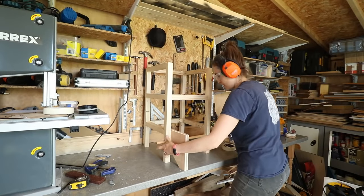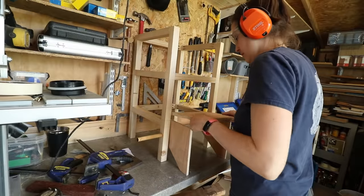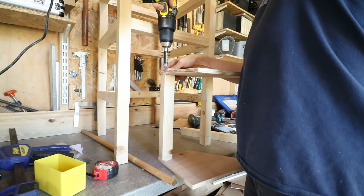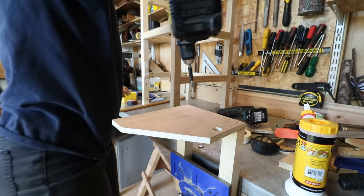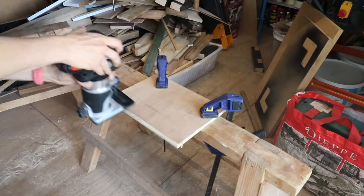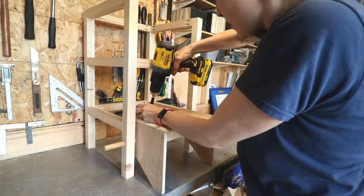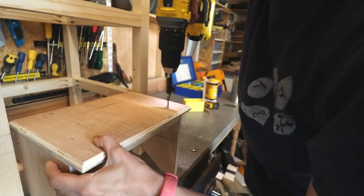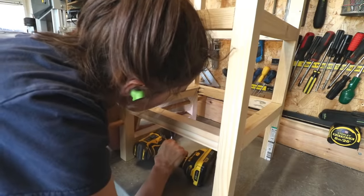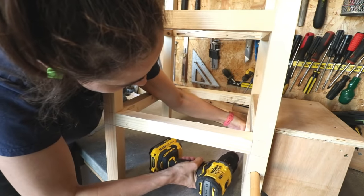At this point I'd made my mind up to just use 12mm for the top of the step section — as long as I had supports there, it'll be sturdy. I didn't want it to be too tight while I opened and closed it, so I offset them a bit. For that I just glued and screwed it. After cutting the top piece, I gave it a quick 45 degree chamfer around the edges and screwed it to the sides. I love this little step, it's so cute. I also dry screwed another support piece where the angled side steps would be resting on — I'll come back to gluing that properly later.